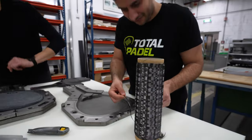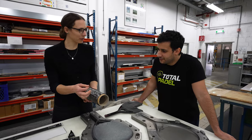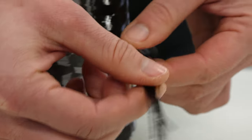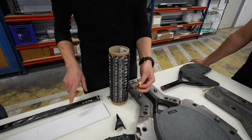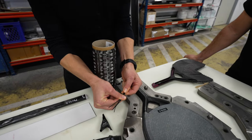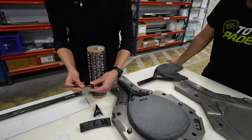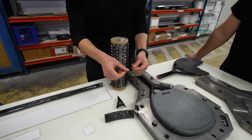This is the raw carbon fiber. Let me show it to you. That's a raw carbon fiber with 12k — 12k means that one tape has 12,000 fibers. It's very important to put the fibers in the right direction in the racket. In this direction I cannot break it — it's super strong. But in this direction it's very easy to break and separate it. So when we engineer the racket we have to make sure that we put different angles inside to make sure that it's not breaking.